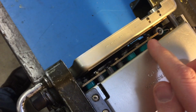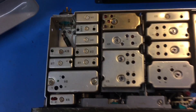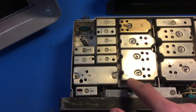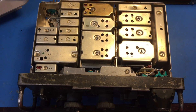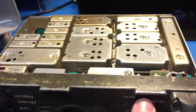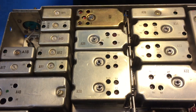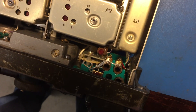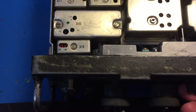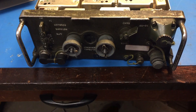You can see those blue connections everywhere. Here's the inside — more modules. Each of these modules, you can actually pop the screw off and they come straight out, so you can replace at a modular level or service the module if you have an extender. Here's another neat thing — this is the band switch. It covers a huge frequency range of 30 to 75 megahertz. When you flip this from one band to the other, there's this mechanical linkage that goes through and changes all kinds of stuff in here. There's the bottom portion of the antenna tuning unit, which moves just as you turn the knobs. More linkages and things — switching from A to B band. There must be the dial light. Really cool stuff. We'll power it up and test it on the bench. Let's see if it works.